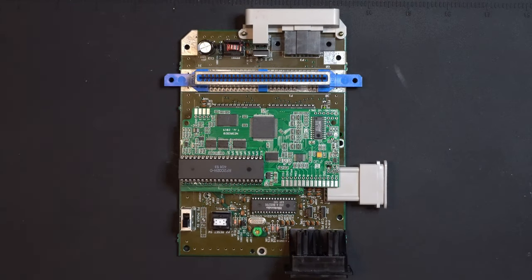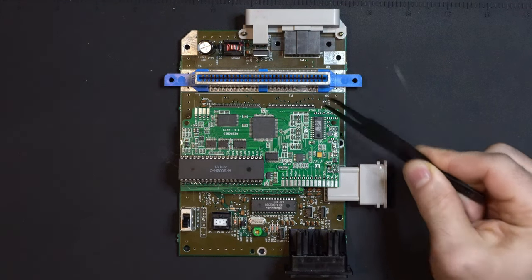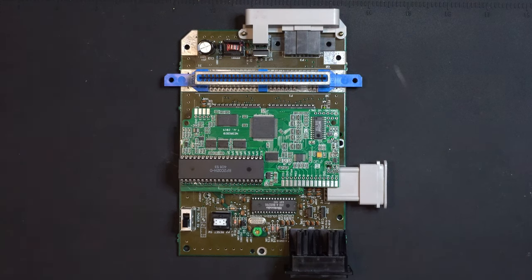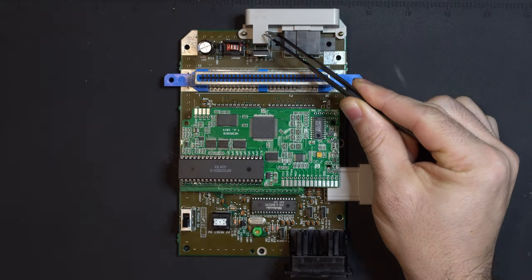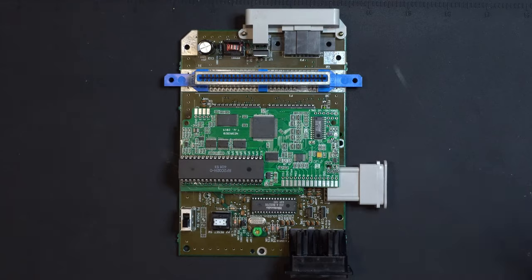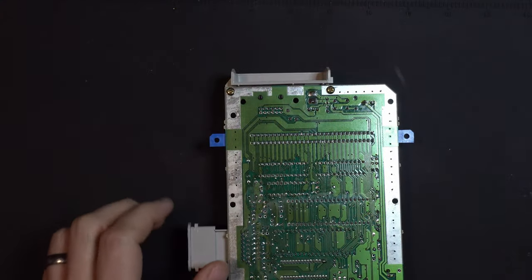This next step is completely optional and is only required if you're looking for a 100% guaranteed jailbar-free video output. This is brought to us from Voultar, who determined through some research that if we separate the grounds from the multi-out, and only, of course, wire those back to the NESRGB, we can get rid of the jailbars. So what we're going to need to do here is take off the panel for the shell and the AV multi-out. So let's flip it around. First, remove these two screws.